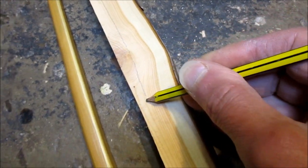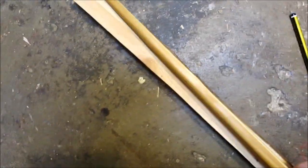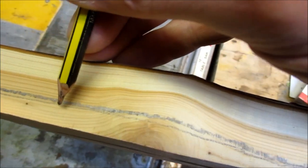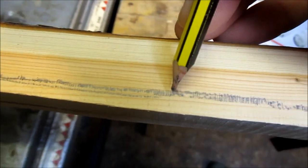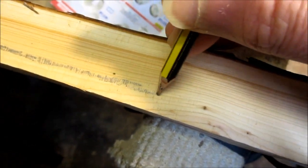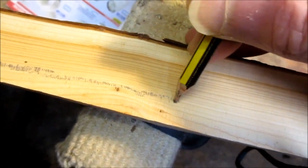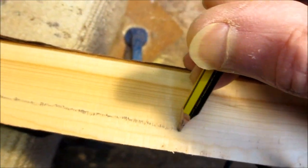It's hard to do with one hand while I'm holding a camera, but you get the general idea. I'll just sketch it in by hand, whizz it through the bandsaw, but it will still be vastly too thick. I'm not getting it down to final dimensions, I'm just getting it roughed. You can see here where my roughing-out line is going to be - we'll actually be taking that knot out, which is nice. It's a very scruffy line because what I do is I pump the pencil back and forth to sort of average out any irregularities. And when I saw out I'll saw the scrap side of the line.